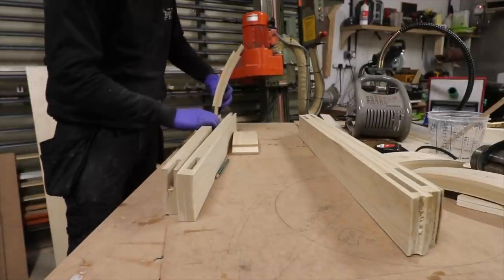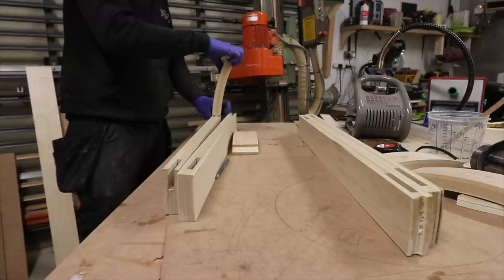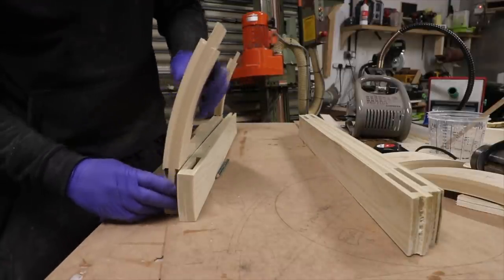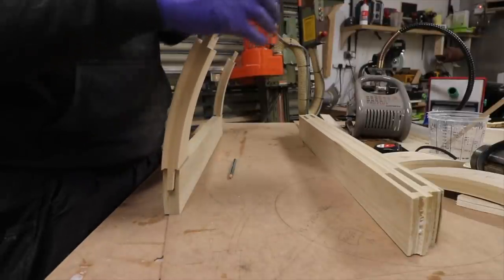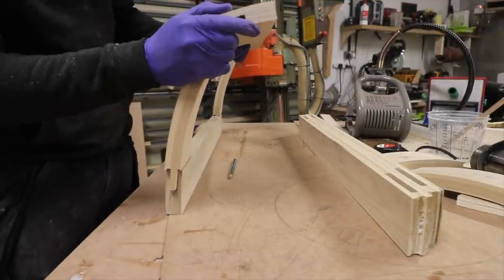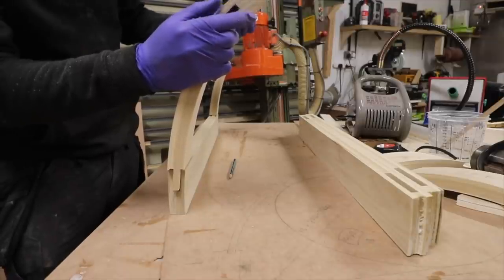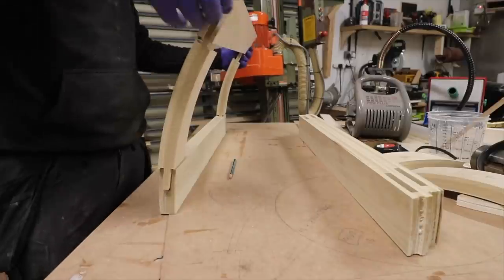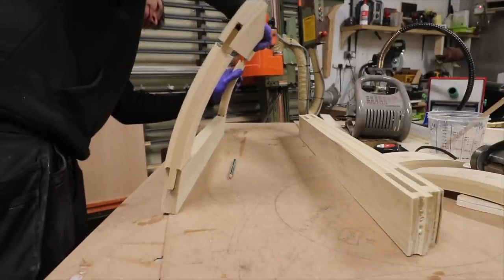Right, that'll do for tonight, but obviously you can't leave without seeing how much progress you've made. So I've still got the little bevel scribes to do, or put the bevels on the rails, but it should just slightly push together. The joints will be slightly misaligned because they've got to go into the tenon more to be absolutely perfect, so another 4 or 5 mil.